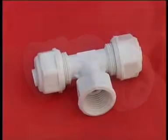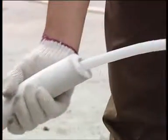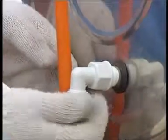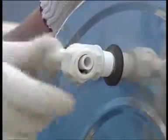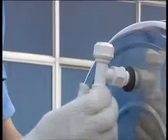Prepare the 3-way connector, connector, and soft plastics against water leakage. Fix the insulation around the PEX pipe. Encase the inlet with the soft plastics against water leakage and install the connector. Install the PEX pipe as the inlet and outlet. Encase the inlet pipe with soft plastics, install the 3-way connector, install the overflowing pipe, and install the inlet pipe.